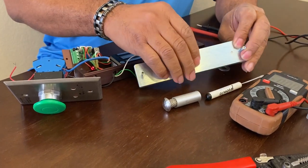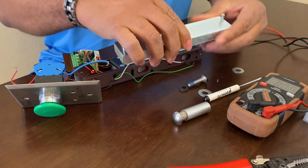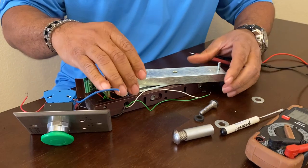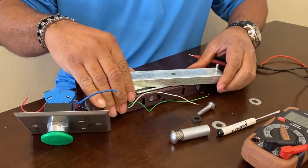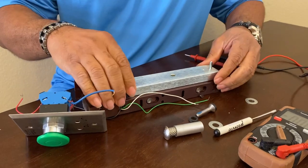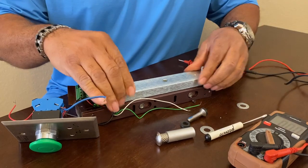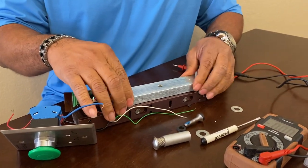The second step also involves the armature plate — you want to make sure it's aligned. We can't have it crooked because the door will open and close and the armature plate will go lopsided. As you can see, I can easily turn the armature plate, and that could be a problem. Once it's fully aligned, I've got a full holding strength — my full 600 pounds with this Alarm Controls magnetic lock.